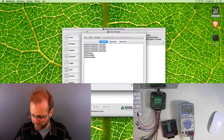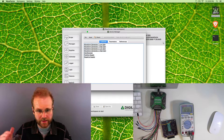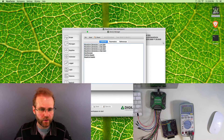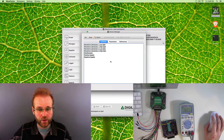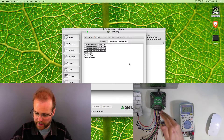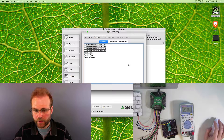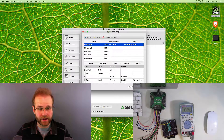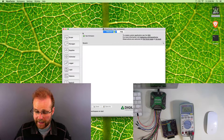Waveform Generator 1 is now calibrated — you'll notice toward the end the values start to dial in closely. Go ahead and repeat this process for Waveform Generator 2, then check the oscilloscope calibration. When done with all of this, click Apply. When prompted whether to apply the calibration changes, confirm yes — at that point the calibration is written into the Analog Discovery itself. Close out of that, and your device is calibrated. Now we can move on to booting up the Memristor Discovery software and taking our first measurement.